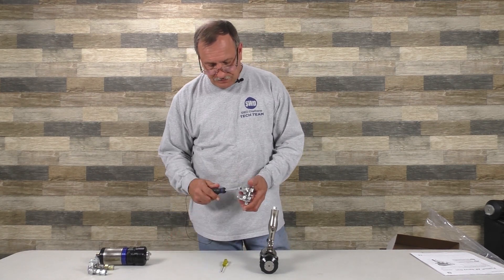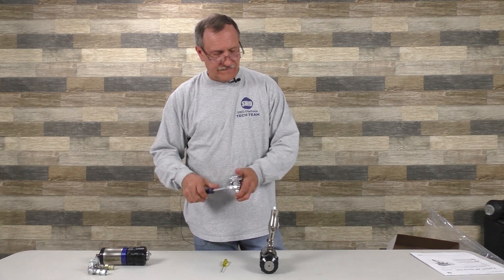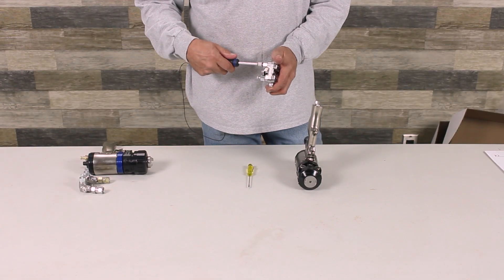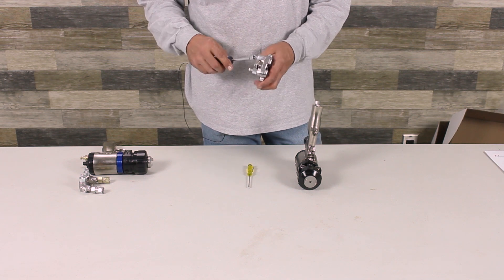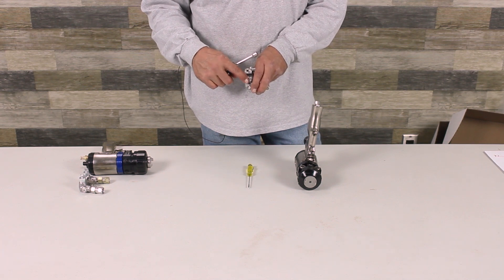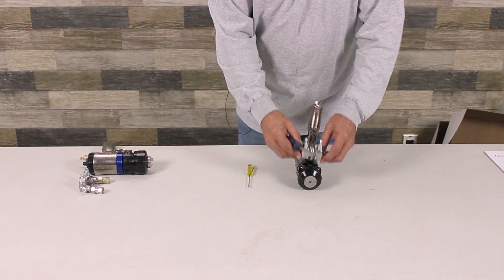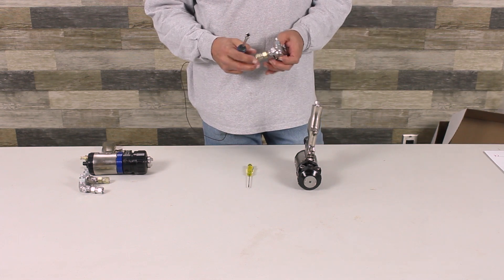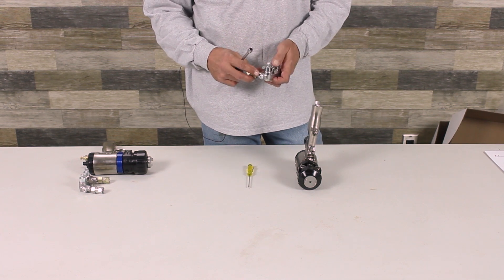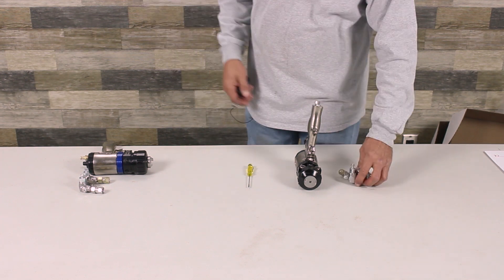This is your gun block. These valves here are going to control the fluid to the gun. Anytime you have to work on these, you have to replace them. When Graco sends you the replacements, open them — if you don't open them and you tighten this down, you're going to mushroom it and the gun's not going to seal. Make sure these are open when you connect it. These are flexible, and a lot of people will have these pointed down with valves. It doesn't matter — whatever way you're used to spraying, you can have the hose come down or come straight back.